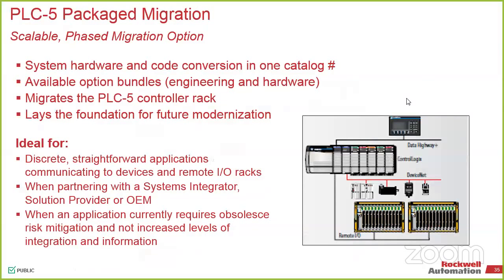Internally, the communication might be different. Internally, the way that you do the add-on profile would be different, but the actual wiring harness is the exact same thing. From a wiring harness point of view, as long as the pinout is the same, it's a don't care from the card. But it is true that from a documentation side, it will not account for every single IO card that we have, which in the ControlLogix world is about 128 different patterns. So there are a couple of them that aren't there, but the main thing to look at is the pinout.